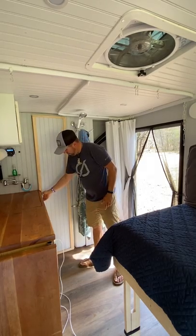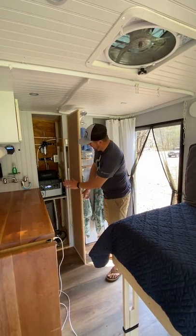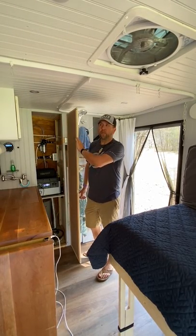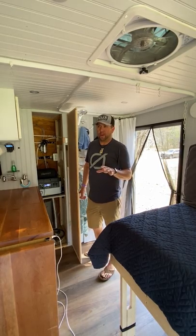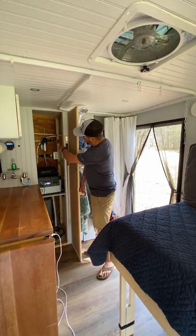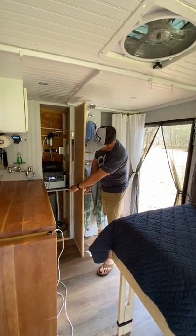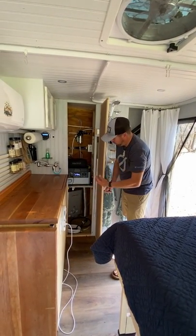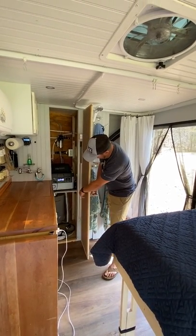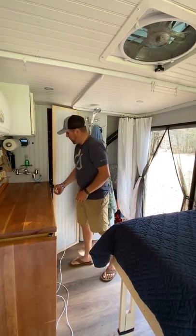Now on the inside of my closet right here — I found a nice little T-Rex door handle, super excited about that. I have my Goal Zero Yeti 1500x connected to a fuse panel in here. This is running every single thing in this trailer and powering it, except for my mini split unit which I run off of shore power. I have my water pump, I have accumulators, half-inch PEX running all of my plumbing. I have a Gasland propane instant hot water tank that's working extremely well. I have my breaker box in there for shore power, storage in there, and my propane is vented out down through the floor so I can keep any fumes from getting in here.